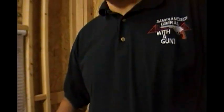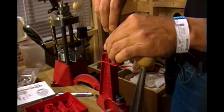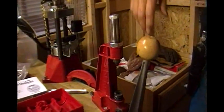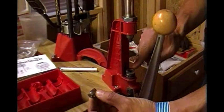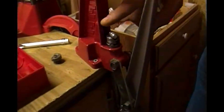The process for using this is basically as follows: you screw it into a single stage press much like this one here. This is the $30 Lee Reloader single stage press. You screw it in finger tight. Then, according to the directions, you would replace the shell holder — I use a number 11 shell holder for 45 Colt and 44 Special — with the little V-block version here. Then you would lay your bullet in and file the top.